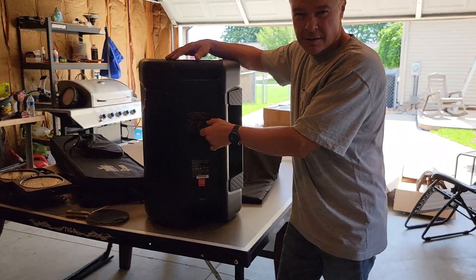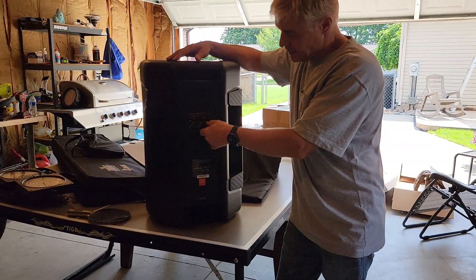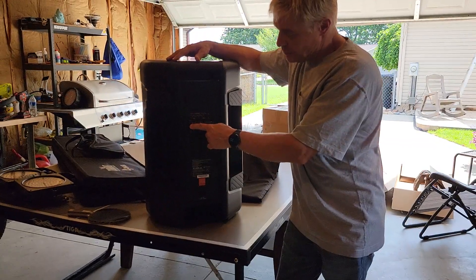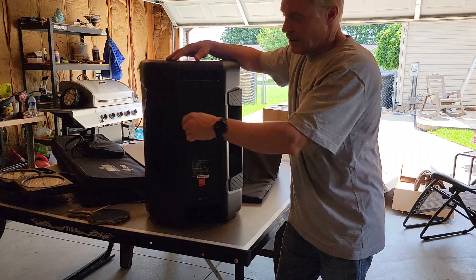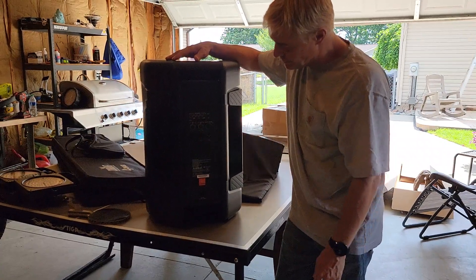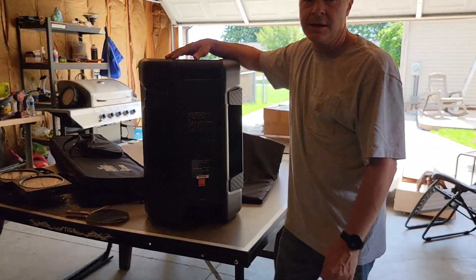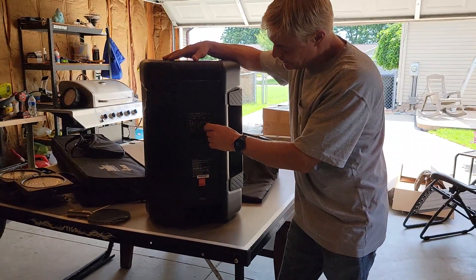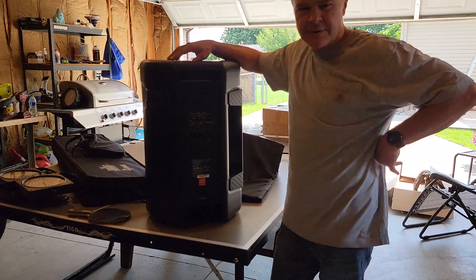For hard-hitting music like rap and hip-hop, you may want to dial the sub down to about 1 o'clock. With the channel at unity and the subwoofer between 2 and 3 o'clock, you should be good on levels. I usually keep my master at negative 10 dB on my Behringer mixer — and it sounded good.